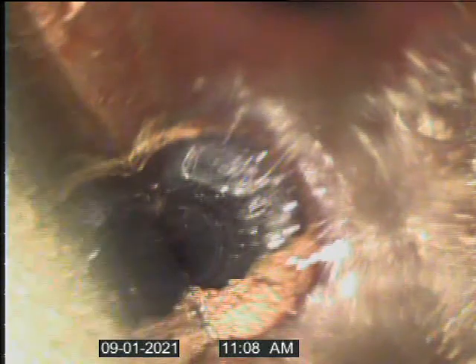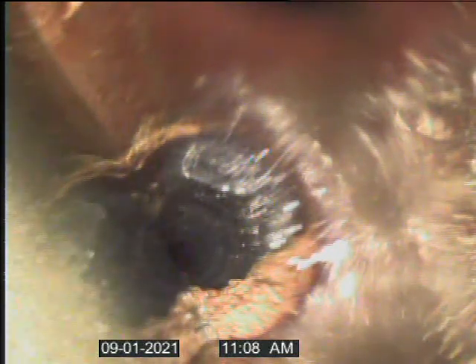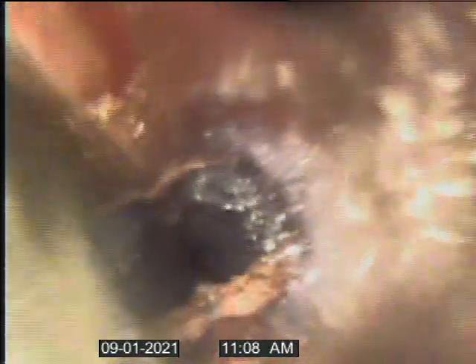I'm out in the yard — I can see the clay, I'm into the clay line now. In these old houses it's usually cast iron under the basement floor. You can see mineral buildup at the joints. They didn't glue the joints in this clay tile; it's a tongue-and-groove system and they just click the pipes together and buried them, so you get some mineral leakage through there.